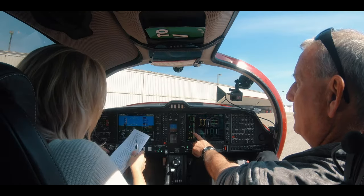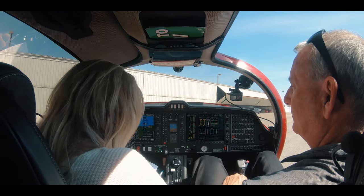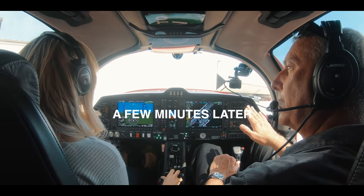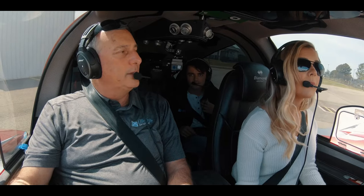That's easy. What do you check next? Just making sure oil pressure is up in the green within 3 seconds. There you go. Looks good. You notice how the nose is all stuck up in the air? Yep. Why is that? You know? Because we've been stepping on the back steps and everything like that. So all I have to do is tap the brakes here. There you go. She squats, she drops right down. Look at that. Yeah, that's pretty cool. Makes it even easier to see over the front now.